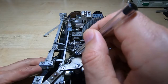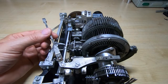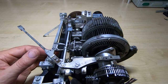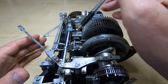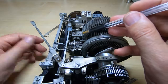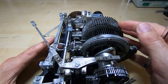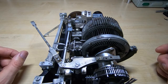There are several other things going on here — one is that this lever I was releasing manually is now being released automatically, and there's an adjusting screw down here used to adjust the point at which this lever disengages. There are quite a few fairly subtle adjustments, but once you examine the machine and see how it all operates it becomes clear what's going on. I'll describe this in more detail once it's screwed back into the machine so I can actually operate it properly and show it running through a full cycle. That's it for this video — the next video I'll be repainting the base, then get these three components bolted back in and show them operating more completely.